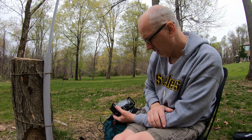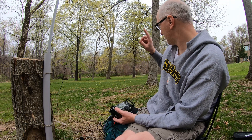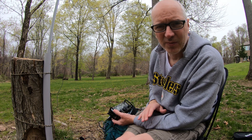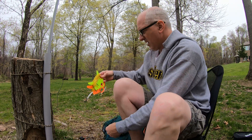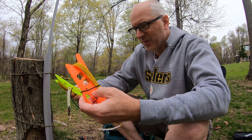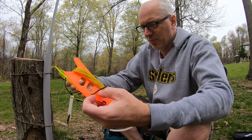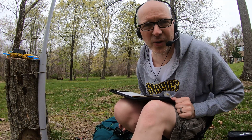73. This is a station in Ohio that I'm picking up on my dipole for 40 meters. I can't tune it — even the Elecraft can only tune it to about a 2.9 to 1 — so I'm not going to try to use that. I have these two lengths and I think this was for exactly this purpose, but I can't remember. I need to see if these are the same length. This one obviously had a connector on it to make a link dipole.